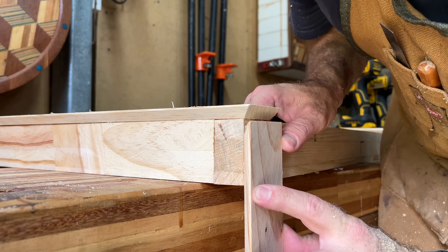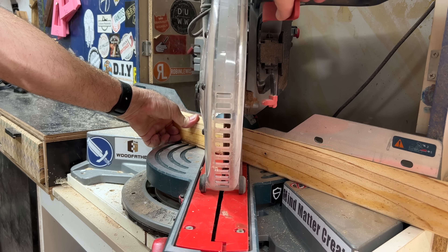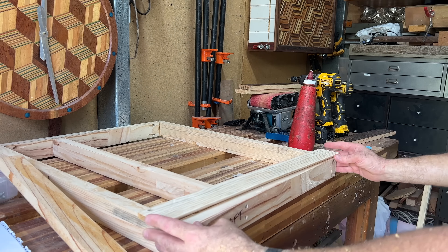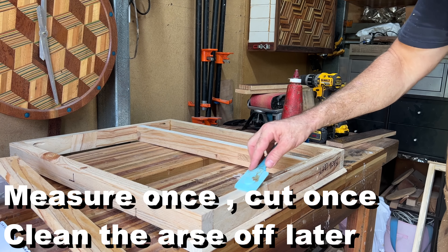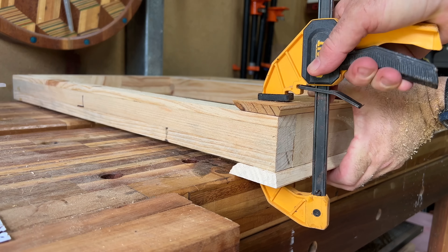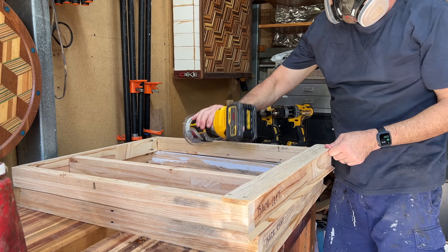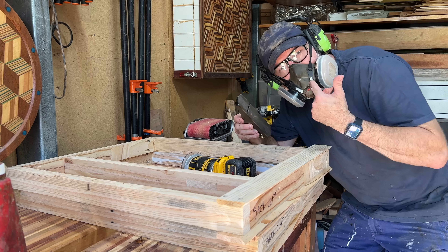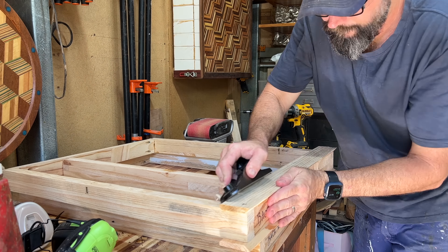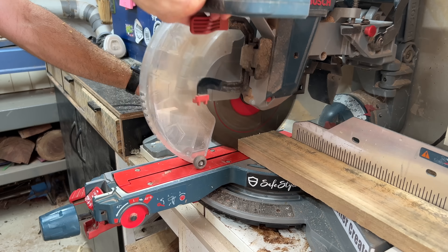I'm stoked, I'm cruising along with this project. Now I can cut a heap of mitres and start to wrap the wood around the frame, making it super duper strong. To make the mitres easy I cut the mitre to an approximate size and then trim off the end later, saving me heaps of grief — measuring twice and cutting multiple times until I get it perfect. Some of the mitres you just have to take your time and sneak up on them, because if you make an error you may have to mill up a whole new piece of pallet wood, like I did.